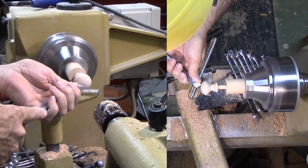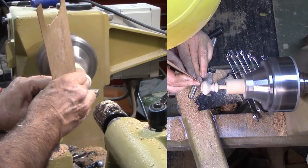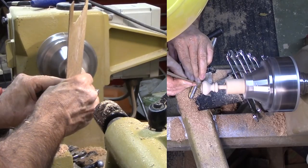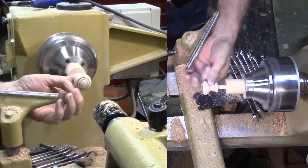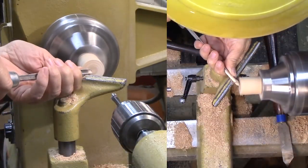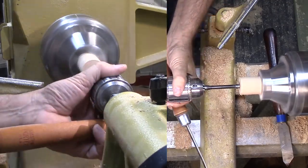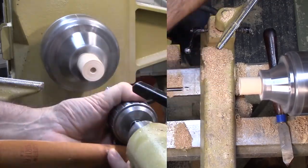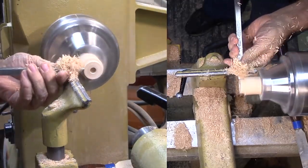After sanding, I cut a couple of V-grooves on the top of the knob. I want to burn them to complement the wood burning. I'm using a piece of scrap countertop material to burn the groove. Finally, I'm making a small button to cover the tenon on the inside of the lid. My lid was too thin to have a shallow mount hole. After applying walnut oil and a good buff, it's finished.